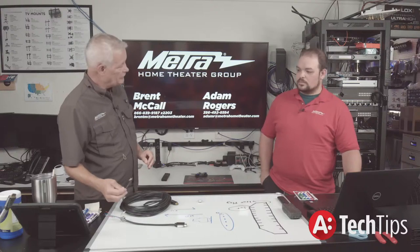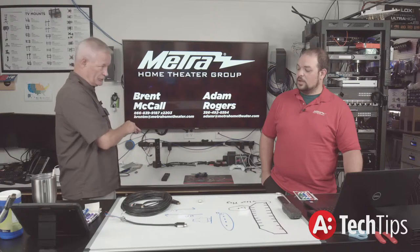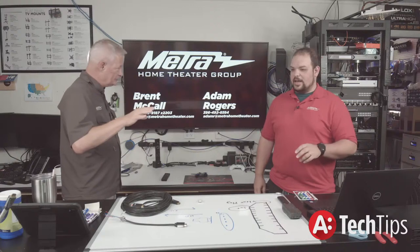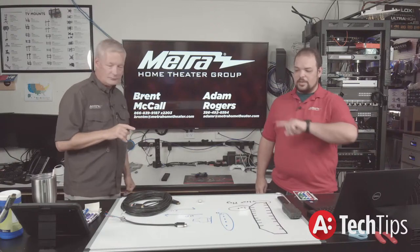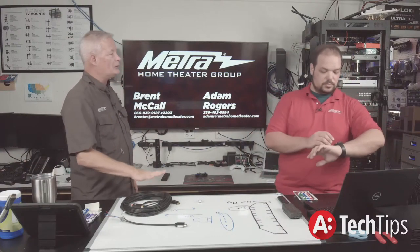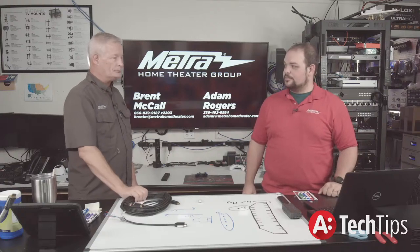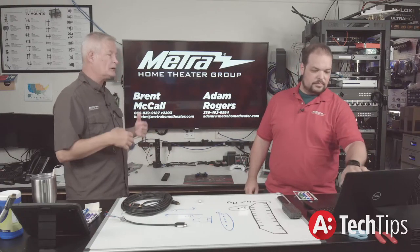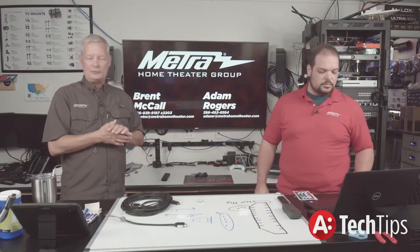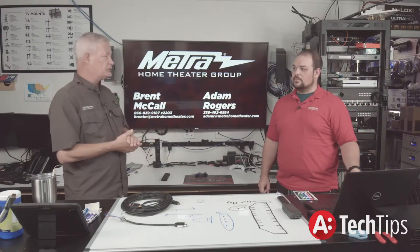You are powering the transmit, the receive, and the output of the source. We'll get deep into this in episode five for TMDS. If something is spec'd for one amp, put in a two-amp power supply. And — every manufacturer faces this except for Apple, because they have the power — don't believe the Chinese ratings on the current rating.